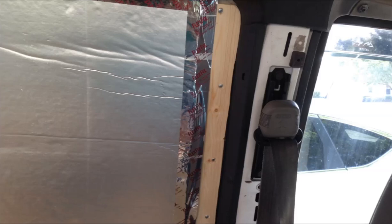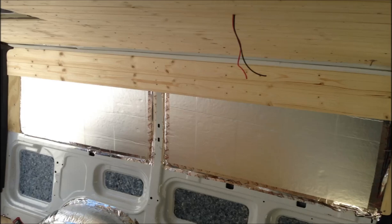Here's a closer look at the board we've got screwed in up at the front of the cargo area. Now that the insulation and boards on both sides are built up even with the center beam, it was time to start putting the planks up on the wall. These planks were eight feet long and this run is just about eight feet long — we had a little piece to cut off, so we measured each one, cut them, tongue-and-grooved them, screwed them in, and they're good to go.